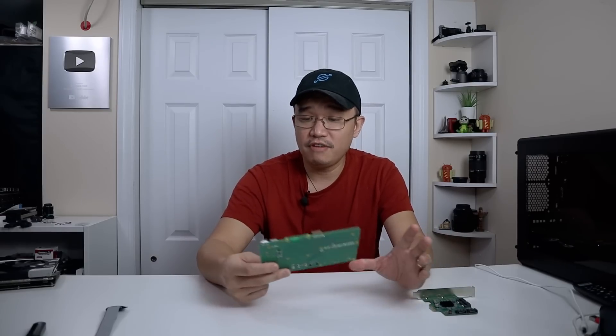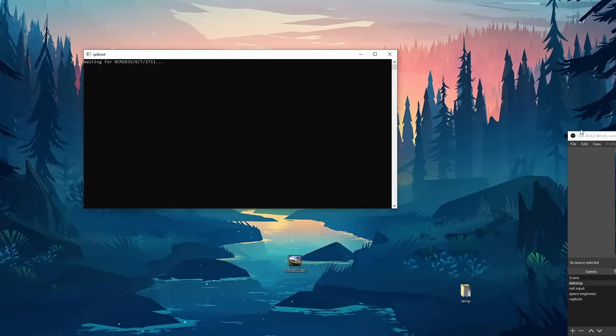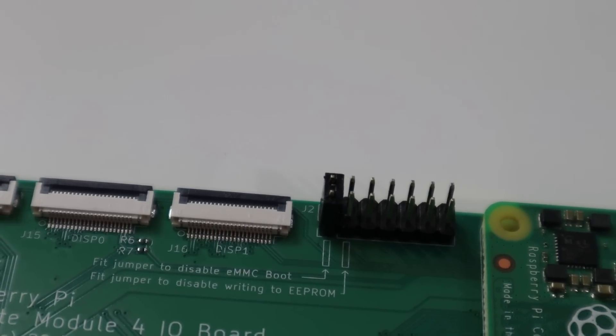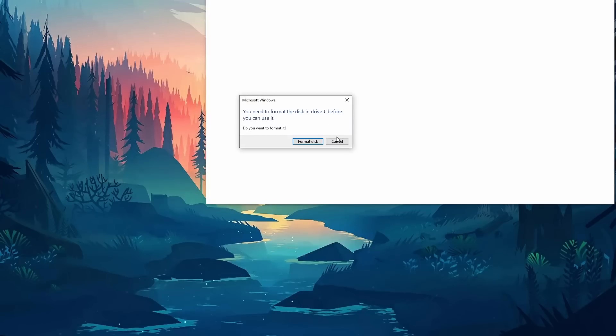That's basically it on the board — I find it very interesting and I can do a lot with it, especially with the PCIe adapter. Now if this is your first time with this board, this is one of those boards that you actually need instructions for. I'm not even kidding — I couldn't get it working at first because it's not something you just jump right into. You need to know where to set the GPIO pins and you need to know that you have to activate the USB hub. First, you install a program called RPiBoot — it runs as a DOS program — and once you turn it on, you are allowed to plug the board into your computer. Set the jumper to make sure eMMC boot is disabled, then plug in the micro USB and then the barrel connector. Once you're done, RPiBoot will detect it and turn it into a storage device so you'll be able to read the eMMC and flash your image.